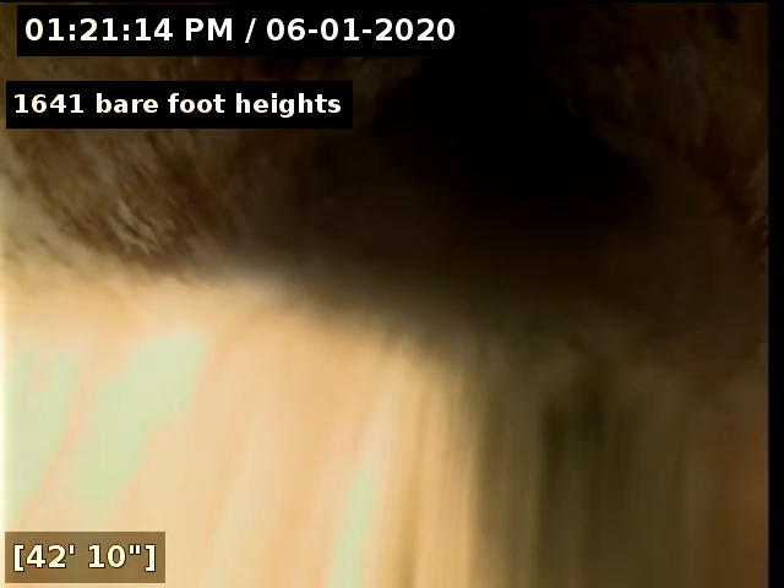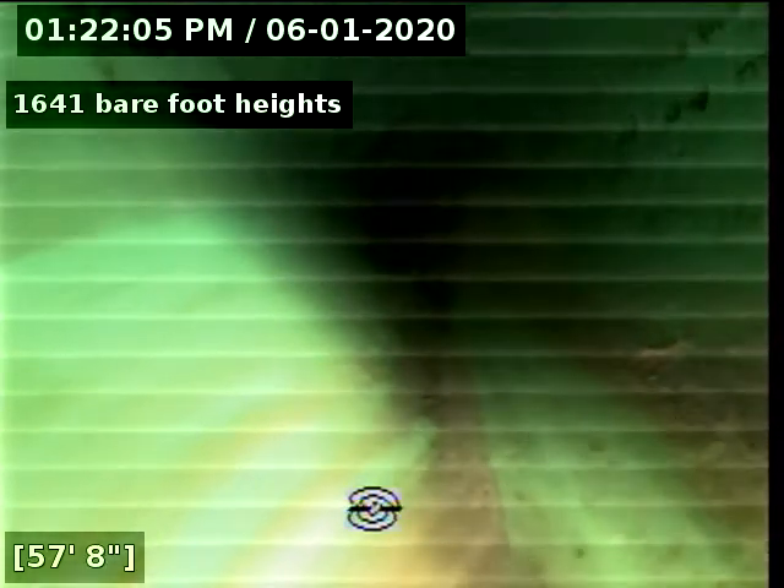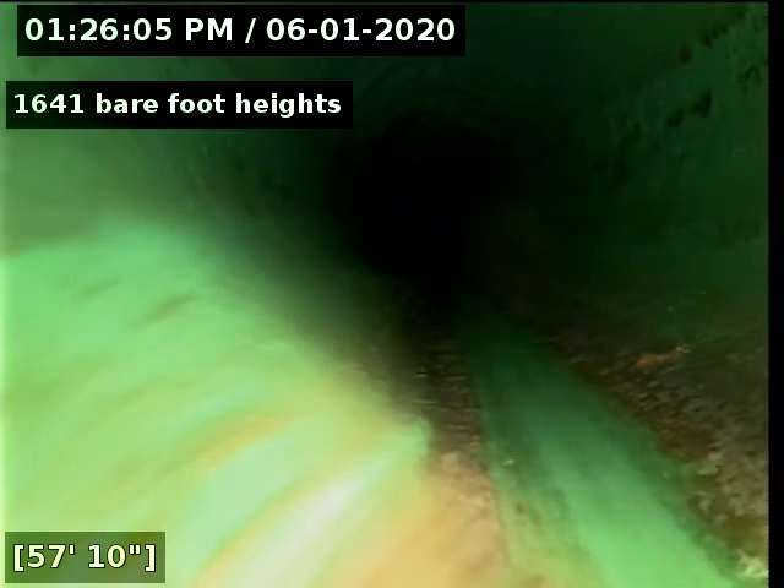Here we just came out of the low spot. Rule of thumb is you do 10 feet after and 10 feet below to locate in order to fix the situation if need be. I'm going to go ahead and do a few locates. I've located this spot in the yard. The city tap I located was 11-3, and this is 11-8.